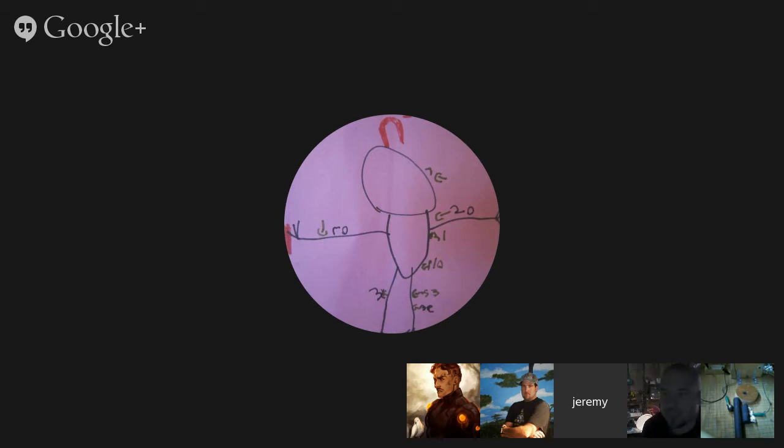I saw some just recently. They're commercial grade ones, like a rotary vane vacuum pump or something like that. But they're really nice for relatively cheap. I'd like to pick one up because this pump that I have doesn't have a check valve in it or anything like that. It's just an air moving pump. It's not necessarily a vacuum pulling pump. So once it hits its limit as per horsepower, it doesn't continue to pull as much as it can.